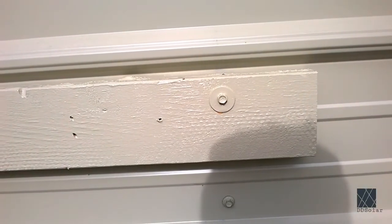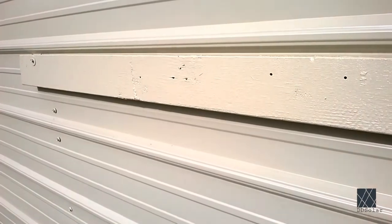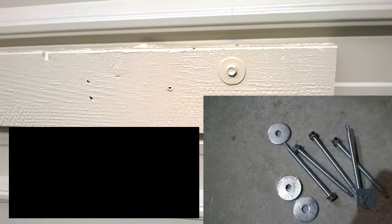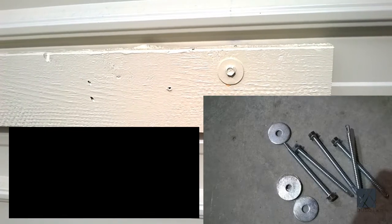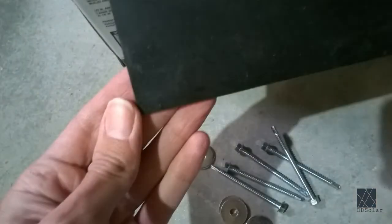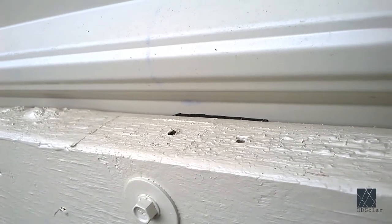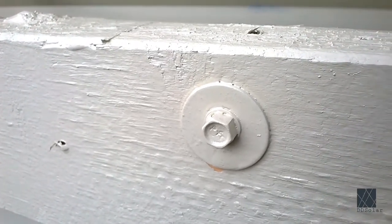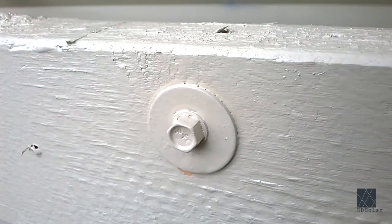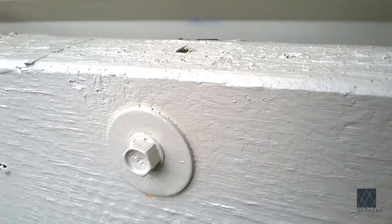Here's a shot of what the mounting solution looks like before any solar panels are placed on it. It's simply a piece of 2x4 lumber recycled from the shed I tore down. I used 3-inch self-drilling metal screws with a single washer underneath, using the existing fastener holes in the building — I did not make any additional holes through the siding. Behind the 2x4 is a layer of neoprene rubber, that black strip you can see just behind the 2x4 up against the siding. Tightening down on the screw compresses the neoprene rubber against the building, creating a buffer to protect the siding and adding a slight flexibility for thermal expansion or contraction.